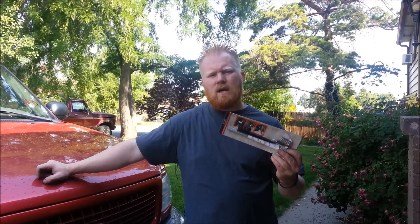I'm doing a repair on a riding mower transmission — it's an aluminum case and I'm going to aluminum weld it, or technically it's actually called brazing. I have this KT aluminum brazing rod. I'll show you how to do it. It's the same stuff Harbor Freight sells as aluminum weld. It's not technically welding, it's brazing, and there's quite a technique to make this stuff work — it's not like a typical welding rod.